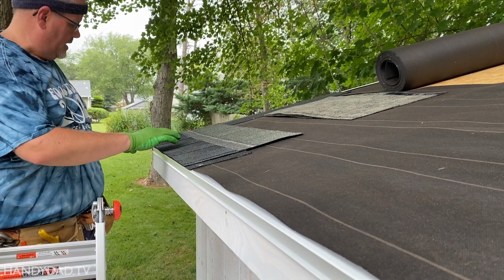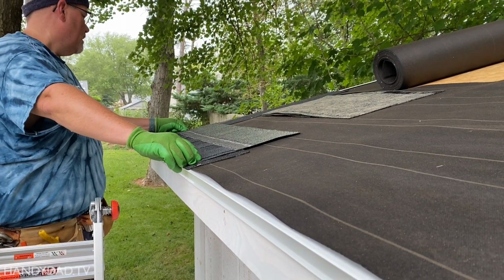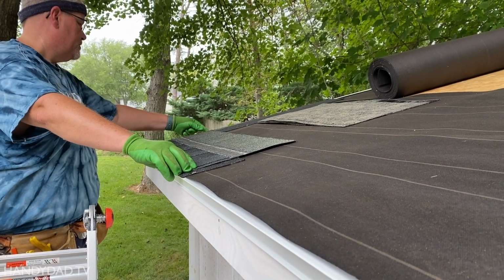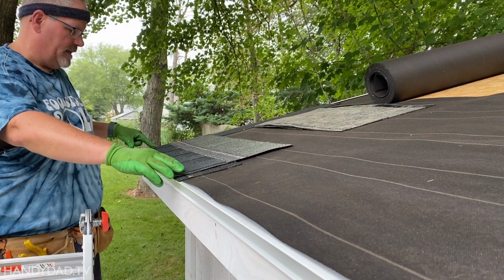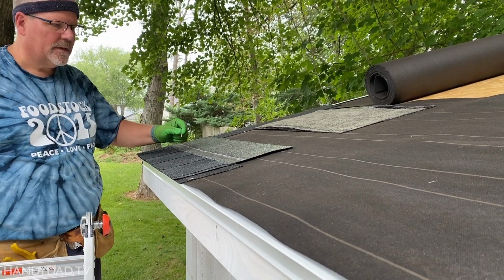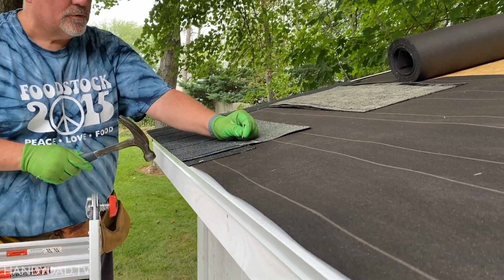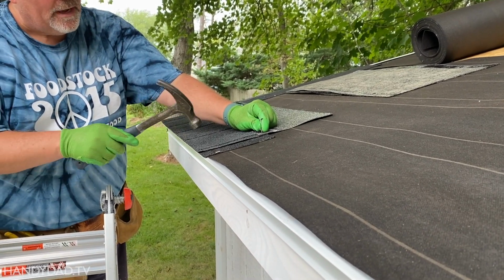That's the way it has to be. And we're just gonna overlap just a little bit. And we're gonna make it even with the edge, because you don't wanna see a jagged edge. I mean, it's only a shingle, it's only a shed, so it's not that critical. But now, when we nail, we're nailing through the layer below it. And these I'm using 1.5-inch nails for.